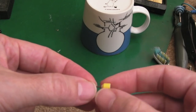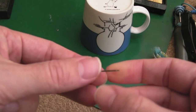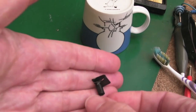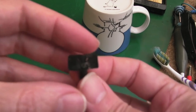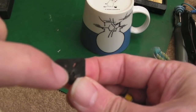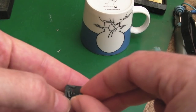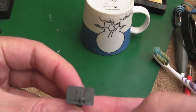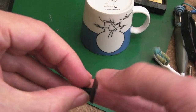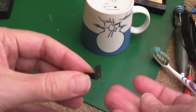There are a few things to mention. The heat shrink is working really well - it's gripping the bar super well, it's not slipping. The bar is nice and straight, I've trimmed off the excess, pulled it through a little bit to make it nice and straight. It fits through here perfectly. Another aspect of this - can you see where we epoxied it? You can see the little slots and those work really well there. But where there's epoxy along the crack, it's letting light through. So what I need to do is get some black acrylic paint and just paint both sides of this so that light can't bleed through the parts where the epoxy is.